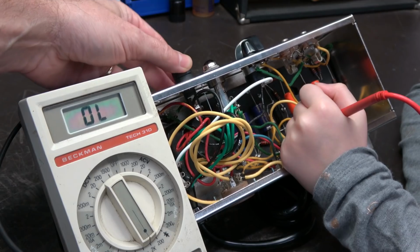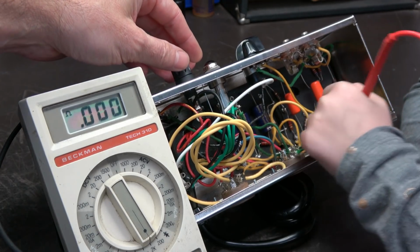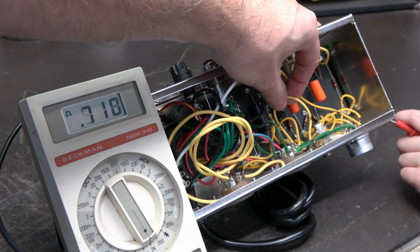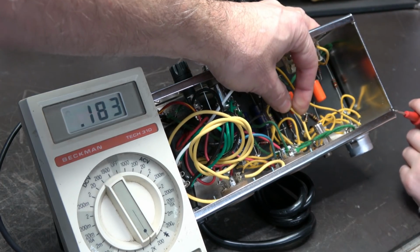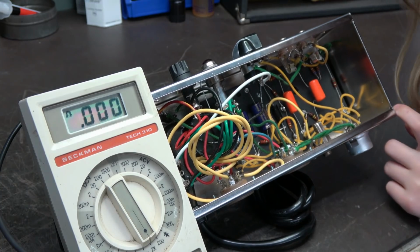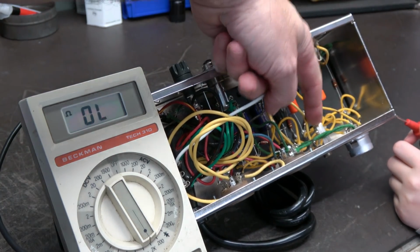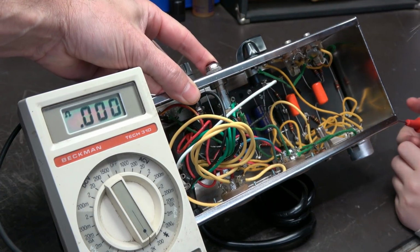Nothing. Open again, huh? Okay, so now pull your hand out of there so people can see. This wire right here goes to the output transformer. This is the secondary. That's what feeds the speaker. And you saw another burnt mark, right? All right, so if you were to take a look, that lead needs to go to this terminal. What do you see? The wires, they're switched.